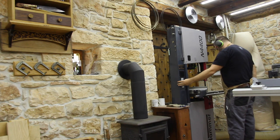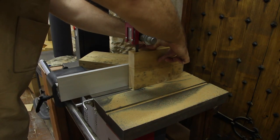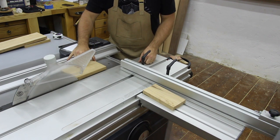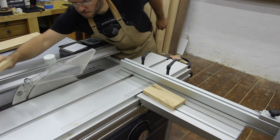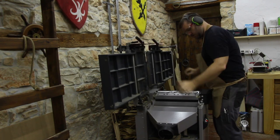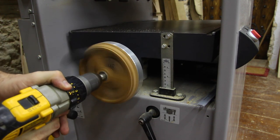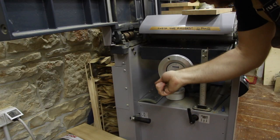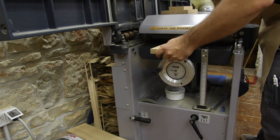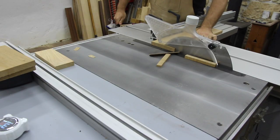Then I use the bandsaw because these pieces are quite thick and I mill them to thinner boards. Once that's done I have a parallel edge from the jointer, then I pass the pieces through the table saw to the final width. Now I prepare my thicknesser to size — I use a drill attachment I made to quickly raise the beds. I'm thicknessing those pieces to very close to the final dimension, though I made quite a mistake later in the video and you will see.